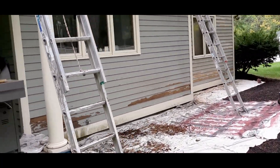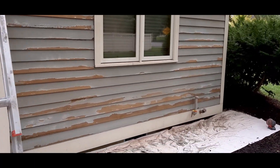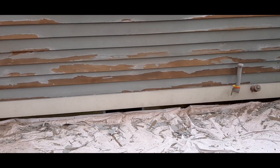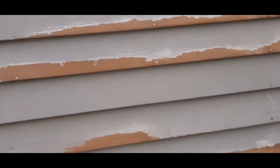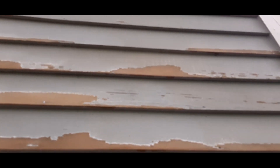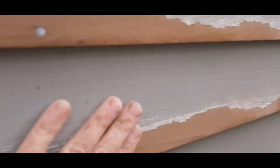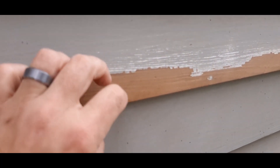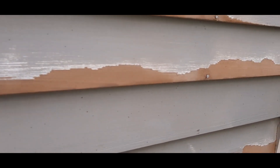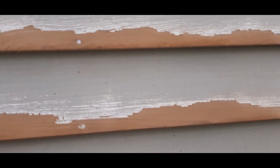These poor people have been through a never-ending nightmare of bad painters, but fortunately they have a good one now. There's a lot of paint coming off this building. I'm scraping and power sanding everything. The only time I won't use a power sander is with lead paint, because I do not want lead poisoning — respirator or not, the stuff will get into your lungs. Sanding gives you a nice smooth feathered edge and also agitates the wood to expose the grain so the California Troubleshooter primer can soak in and adhere properly.